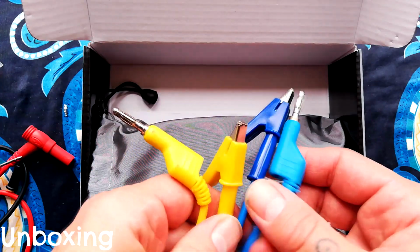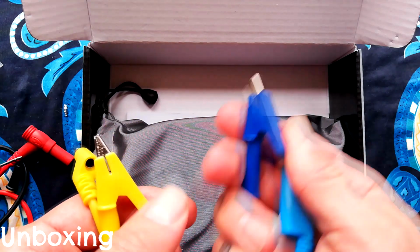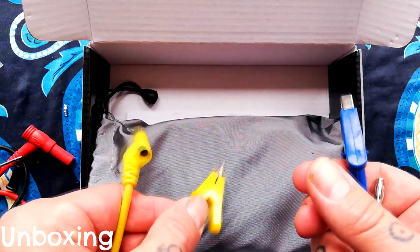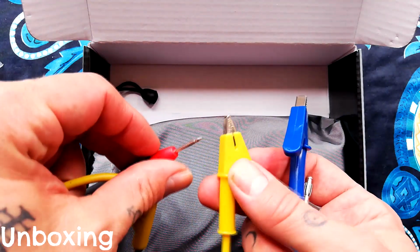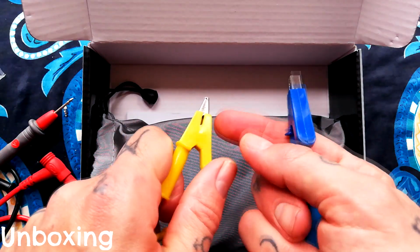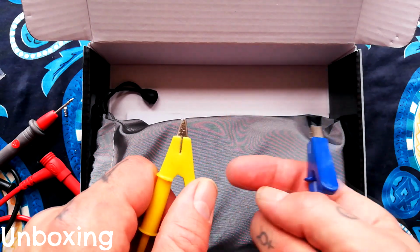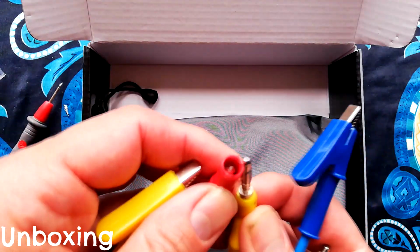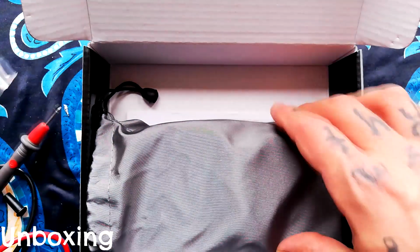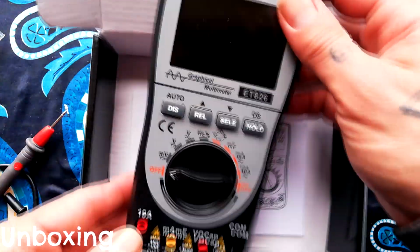I actually prefer to work with banana cables leading to crocodile clips here, because if I'm using this darker colour to represent ground, I can clip that onto the chassis somewhere and I can just move around that, touching contacts much as I would do with the positive probe here, but I can also clip onto the exposed wire on a resistor, or a little bit of protruding wire on the rear side of a PCB. I find that these kinds of sockets are actually compatible. I can fit that into the socket for this on the main unit, which is inside this glossy bag.